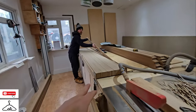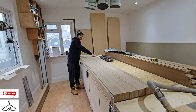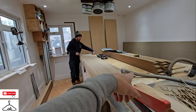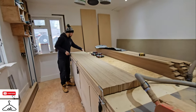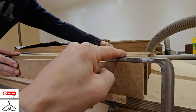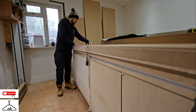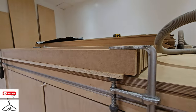So anyway, he's got 2 stacks and we've worked out that we get about 97-ish strips — minus 3 on that side — so roughly 90-95 per pack with 600mm clamps. You can see here where he's got that strip low as well. Where we've got this clamp, the sander sails past that clamp — very clever, Sean. I made that mistake last time. Anyway, there's a little tip for you — have that strip lower so the sander sails past it.